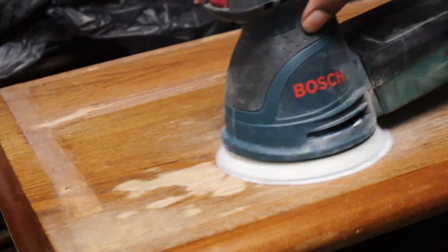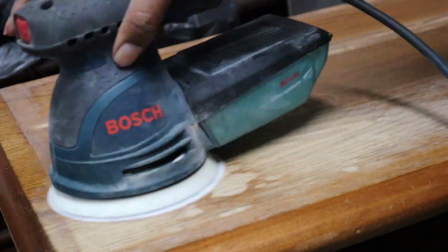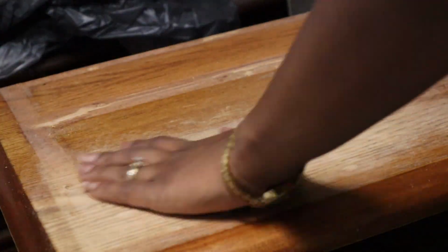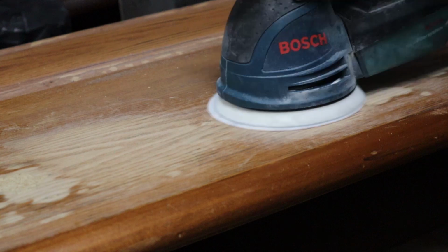After the knots were down, there was some, and actually I remember it was plywood exposed, and it just kind of changed the texture of the top of the dresser. So I went ahead and put some wood filler on there just to smooth it down, and then I lightly sanded it with 220 grit, and it gave it a more even surface to paint on.